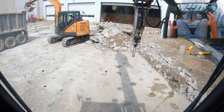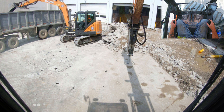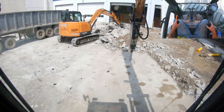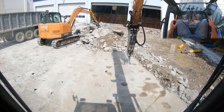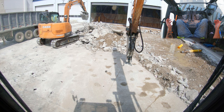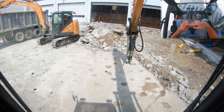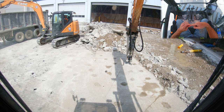There is a method to the madness. The first thing we're going to cover is the most important thing — the shank. The actual piece coming out of the bottom of that hammer that hammers things is really expensive. You don't want to break that. How do you break that? That's really easy. When you go down and you've got this thing buried in concrete — let's go ahead and smack ourselves a little hole here — if you start to really reef on this thing back or forth towards the machine, that thing's gonna bend and snap and you're gonna have a really bad day.